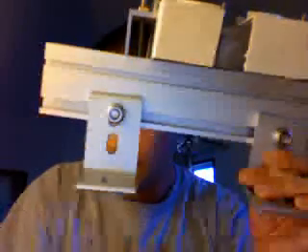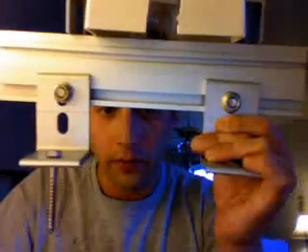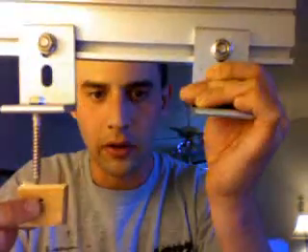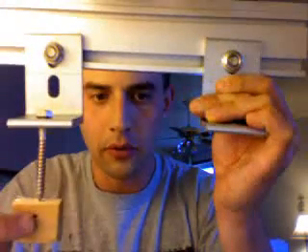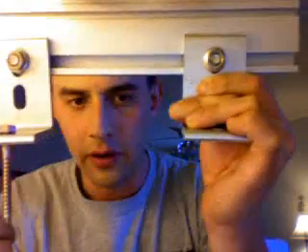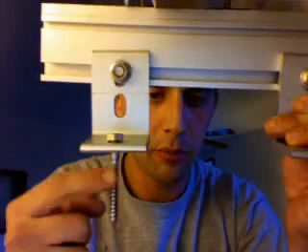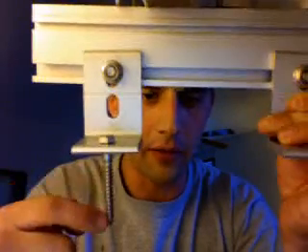These are the L-Feet, and you use a two-inch lag screw. You do the L-Feet, drop it in through your shingles, and drill it into your rafter. You can use silicone underneath here just to keep it weatherproof and watertight. You can put some silicone on the lag screw as well.